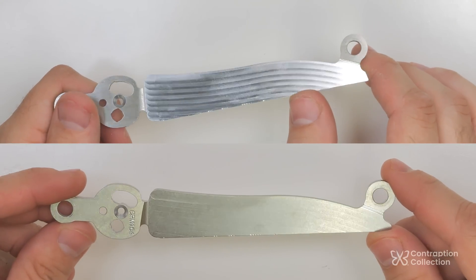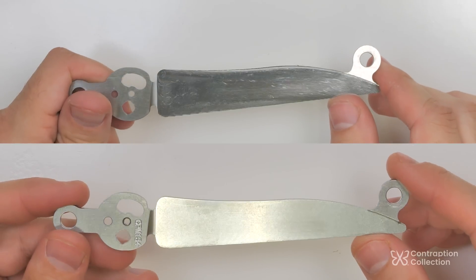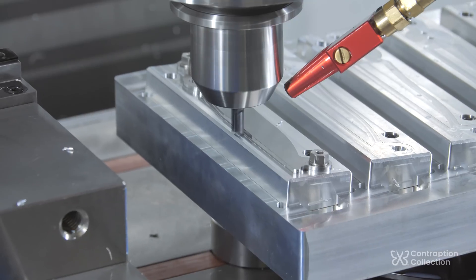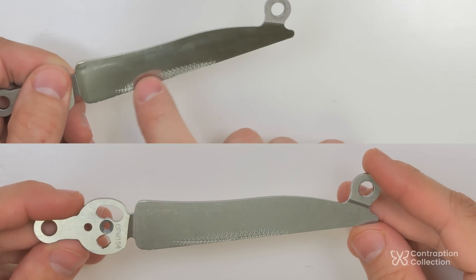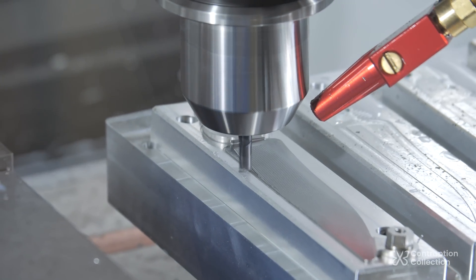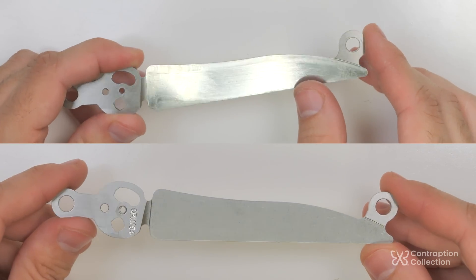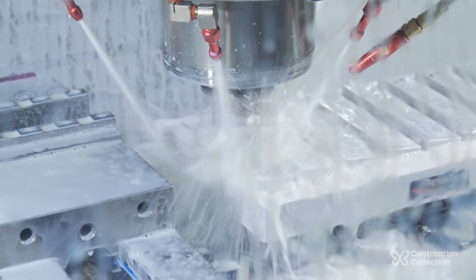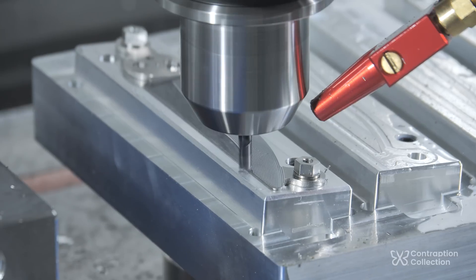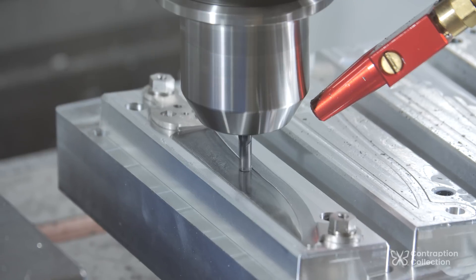I tried a lot of different speeds and feeds, different step-overs, adding a semi-finish pass, bigger tools. The blade just wants to grab or vibrate in the center — I really didn't want to have to add another tab and remake the fixture. What really helped was switching from a quarter inch to a 3/16-inch tool — it's less tool pressure so it grabbed much less. I also found using coolant helps. Adding a semi-finishing pass didn't seem to help though. What helped the most is more step-overs — so I'm taking a bunch of 10-thou-wide, 10-thou-deep passes.